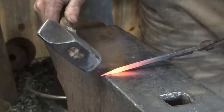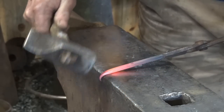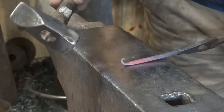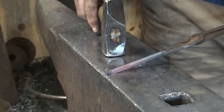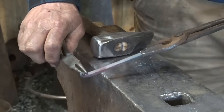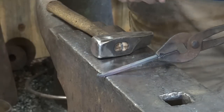I want to take our little taper and just gently forge, working off the edge of the anvil with kind of glancing blows, a little curl. If you're working in a coal fire, this is going to be easy to burn off — be careful, don't get it too hot. Now you can cheat and use a pair of round nose pliers to make these curls, but you'll learn a lot more doing them at the edge of the anvil.